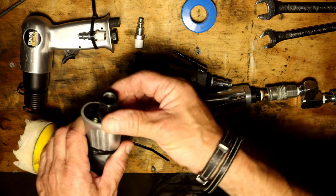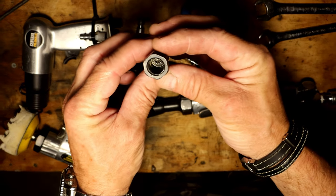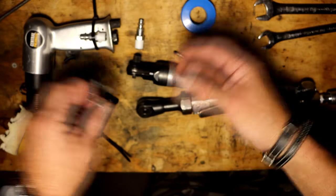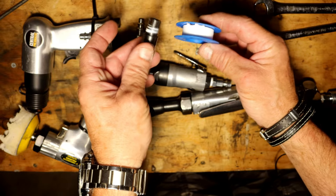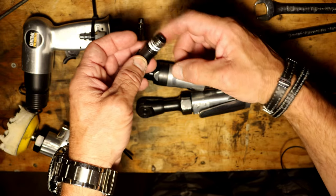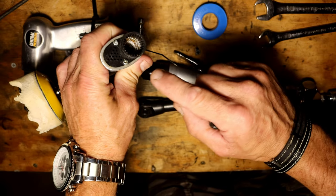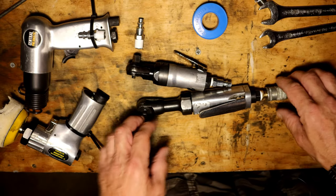Here's a bunch of my air tools, and all of them have that inlet screen in common. I'll take this one out so you can see — there is an inlet screen in there, and it's there to protect the tool from debris coming from the air hose. I use PTFE thread seal tape to seal the fittings so they don't leak. Make sure you don't overdo it or get the thread tape outside the thread so that it falls into the orifice — you can see I got some in there that I need to clean out too.